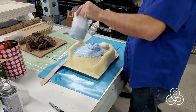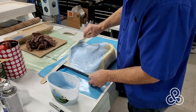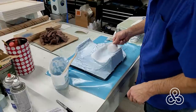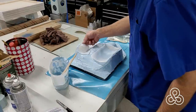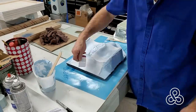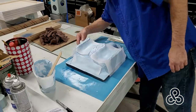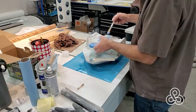I'm going to put the same kind of shell on the backside that I created from that original casting — epoxy with fiberglass. I've coated this whole thing up with a slurry, which is epoxy with microspheres mixed into it to thicken it up. Before it cures, I'm just going to put some peel ply on it and use a little plastic piece to smooth it out — saves me a bunch of sanding time. Peel ply I can just tear off once the thing's cured and it'll be fairly smooth. I'm also going to throw a piece of plywood on top. These three little parts that stick up are a little bit thicker because they're going to create some legs — the feet of this die when it sits down on the workbench.